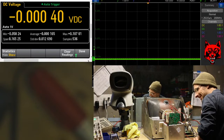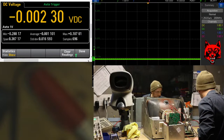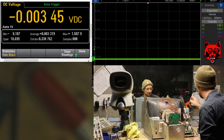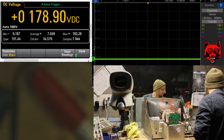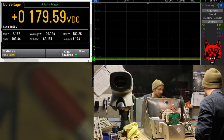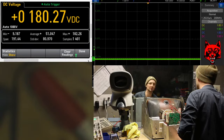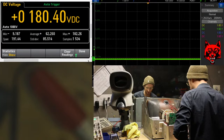It's supposed to be at 181 on the video B+. Yeah, that's high voltage. What did it go to? Where's my ground here? 178. Huh. It's probably going to crawl up to like 188 after you warm it up. But that's good enough. We have an image. I'm going to slowly turn. Oh, that's pretty scrambled.